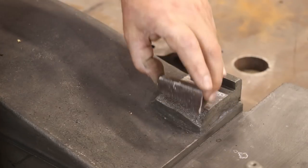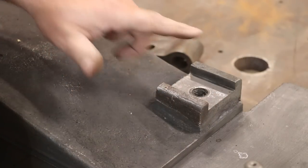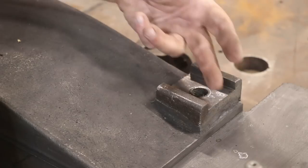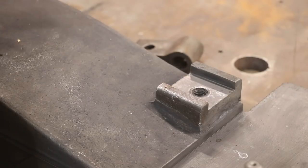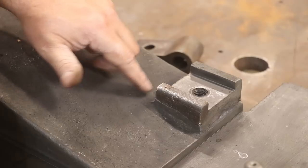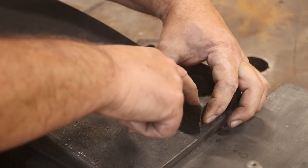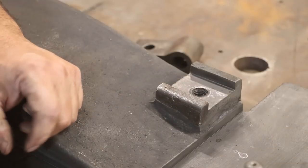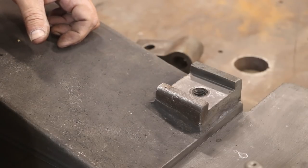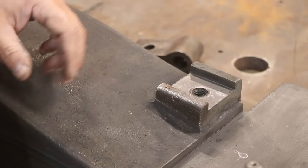My game plan is a combination of two things. First, we're going to braze it back in place on three sides. I'm not going to put any braze on the inside joint because I don't want to have to grind or mill it, and I don't have a machine I'm comfortable using to mill that back out. Then when I'm done, I'm going to take this over to the radial drill, drill and tap a couple of holes, and put some screws through that will give it additional strength. Between the brazing and the screws, it'll probably be overkill — but it's worth overdoing.